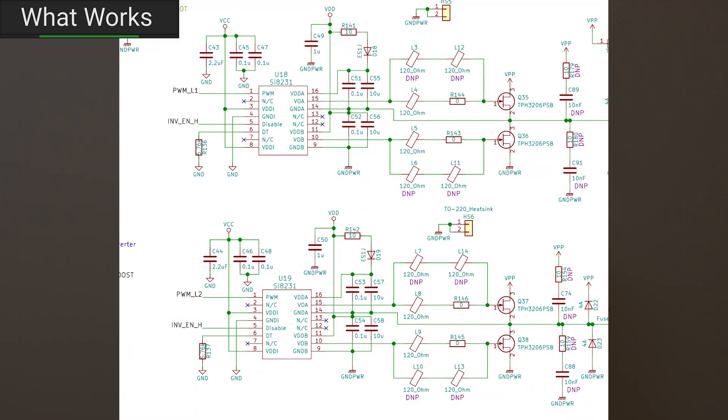Every other detail of this design will need at least a minor tweak. One great example of where cost can be removed is the inverter transistors. We're using some very expensive gallium nitride MOSFETs and I really don't think they're technically necessary — they cost like $15 each. I found some parts based on traditional silicon FETs for only a couple dollars. We'll also save cost by trimming excessive parts, using more surface mount parts, and having more common parts throughout the design.